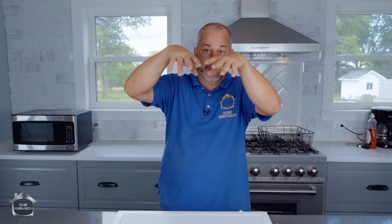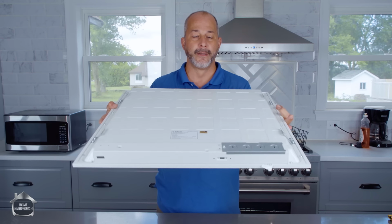If you have an existing ceiling and you've got big box square can lights, like those old 9 by 9 inches, and you got to put in your bulb and they got a little piece of loose glass just floating there, and you want to upgrade, you can actually remove that one ceiling panel. You can go to the local store and get a replacement panel. If it's a 2 by 2 foot, you can get a bar and drop that in and replace it with one of these, all right?